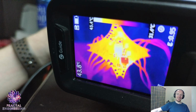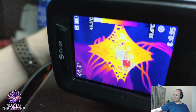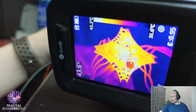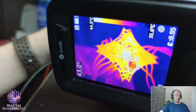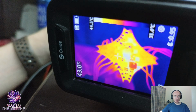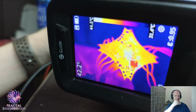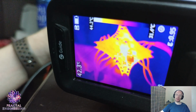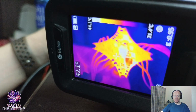Yeah, most of the biggest discoveries in humanity have been made by mistake, right? And I gave a previous ESC some heat. And of course it would go tick tick tick tick tick, fail to start, the ESC would get hot, but since it's plugged on a limited current power supply, it wouldn't blow, it would just get hot. So I kept giving it some heat, see what happens, and all of a sudden it started.